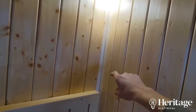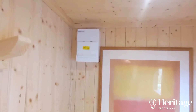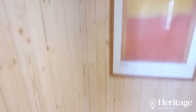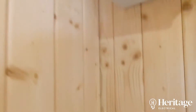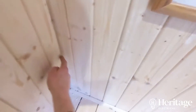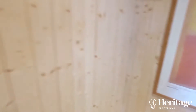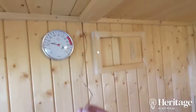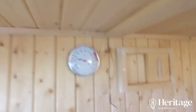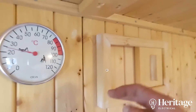I'm going to come along here and multi-tool out a very fine groove to run the cable in. There's also a piece of trim that sits in that corner to hide it. We're going to drop down — again just taking a piece of trim off, carefully drill through into next door. The consumer unit and all the control gear, we're going to move that below this bench. I've taken a piece of trim off and I'm going to run this cable down. There's the hole where it comes through — just drop it down behind the bench so we're not going to see any of that cabling. There's the cable for the temperature sensor — you can see a tiny bit of cable there, but we could just tuck that in between those two pieces.